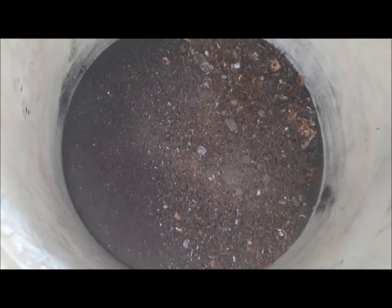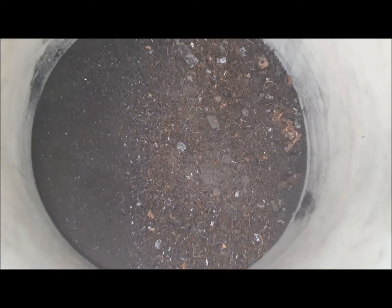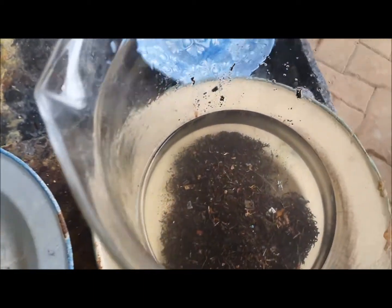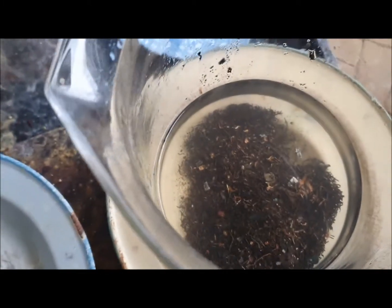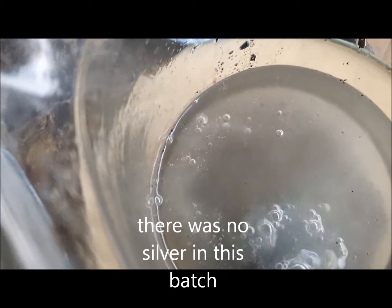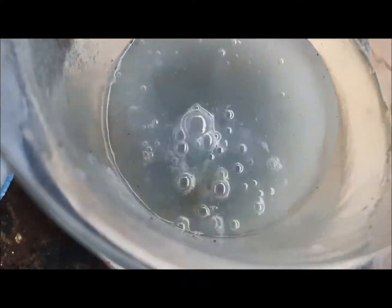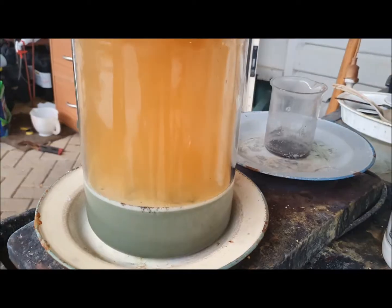Once I've washed all the ash out I can treat it with nitric acid to see if there's anything like silver in there, plus it'll eat up all the copper and hopefully leave just gold. I've completely and thoroughly washed all the residue, and now I'm going to put some nitric acid in there. There's water in there at the moment. I'll put a fair bit because there's a lot of copper — I'll just dissolve all that copper. I don't think there'll be any silver in LEDs but you never know.